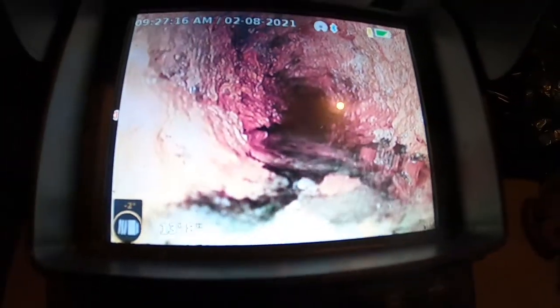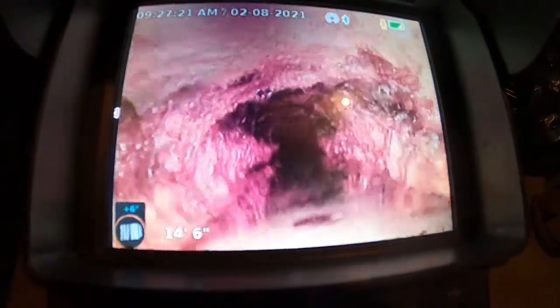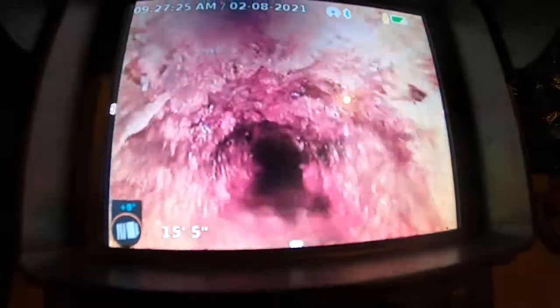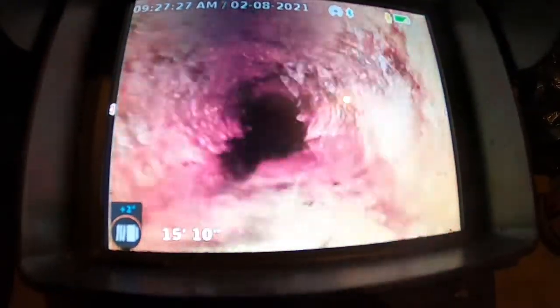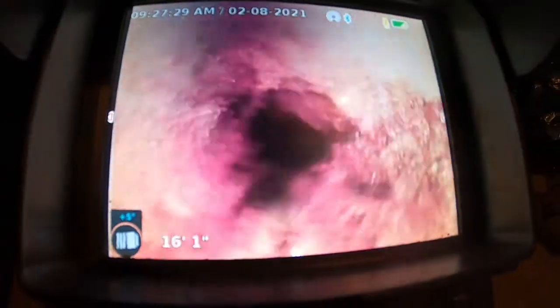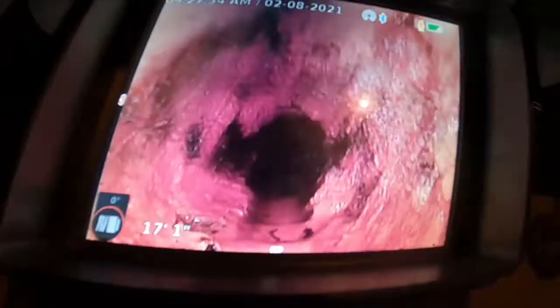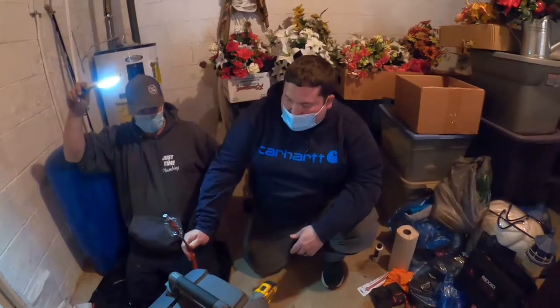So that's what we wanted to see — we're starting to get water flow, and essentially this is just grease and lime scale, years and years of buildup. This is the way of revitalizing the cast iron under the slab without having to do major saw cutting and replacement.